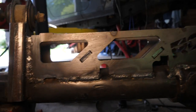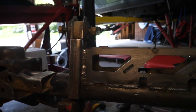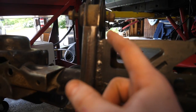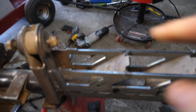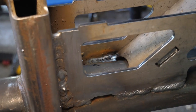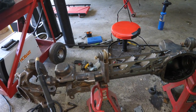Things are going pretty well with this truss and gusset kit. Just got our first welds down. I'm a little rusty but fairly proud of these, especially this one right here. But right here and on the other side I had to do a little bit of gap filling. There's a pretty sizable, at least quarter inch, maybe bigger gap here, so I basically had to do spot welds - weld, stop, let it cool, keep going. These sections have matched up well. Welding to the cast wasn't as scary as I thought. Haven't cracked anything yet - knock on wood. I've gone ahead and welded inside in addition to welding the outside just to make it even stronger. I'm allowing this to cool down a little before diving into anything else, but I'll probably weld this little curve at the bottom of this support, same thing over here, and lay a bead in those corners as well.